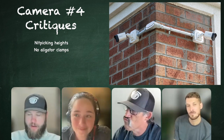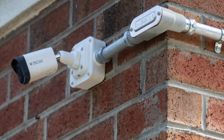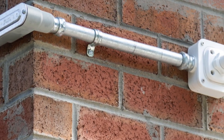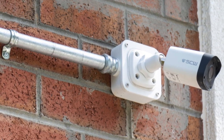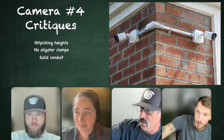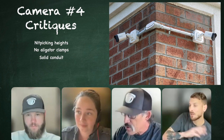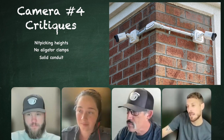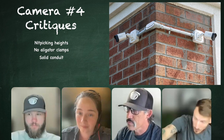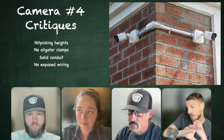I get a couple questions about this, for somebody who does new installation or doesn't know where wires are going. We've got the camera here on the left, and then it's attached by, what is this metal thing called? Line box. LB. Often used at the point where you will begin pulling wire through the conduit, which does not appear to be a junction box. Both cables are coming through behind one of the electrical box mounts for the camera, but that little 90 LB or elbow, it has a cap on it. Both cables come through the electrical box mount on the right, and you can pull to the left camera through that little elbow around the corner, so you're not putting any undue stress on the cable when you go from one box to the other.